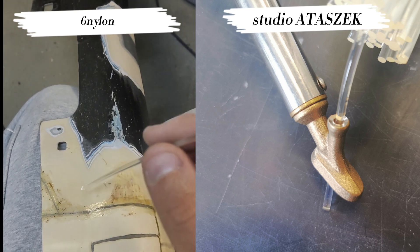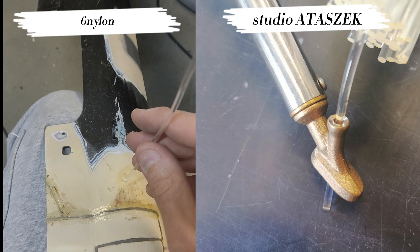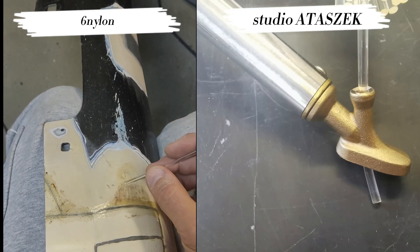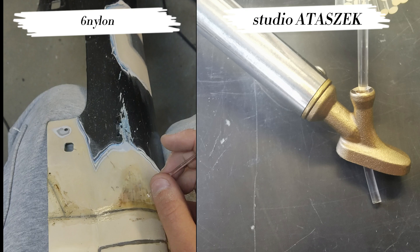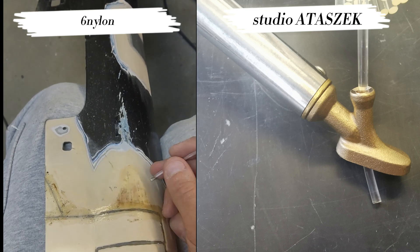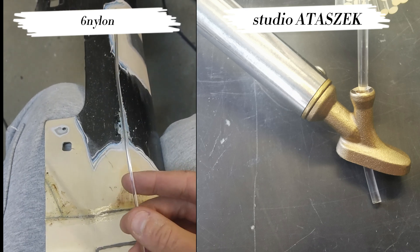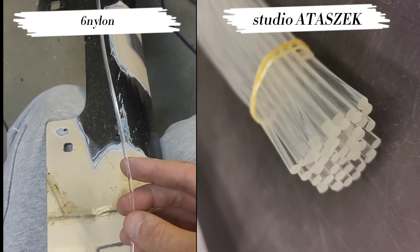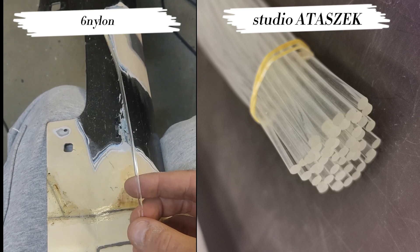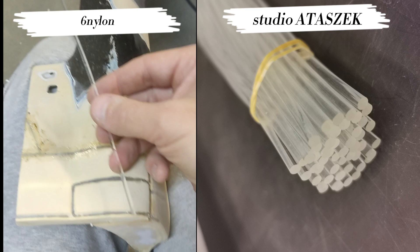The melting process is smooth and continuous. There is no need to force this filler material. If the diameter were larger, it doesn't melt well; if the diameter were smaller, it's also suboptimal. This diameter is perfectly maintained, probably with an accuracy of one-tenth of a millimetre, because there are really no thickenings and no thin areas on it. Really excellent solder from this perspective.